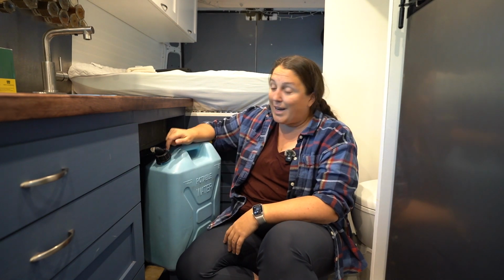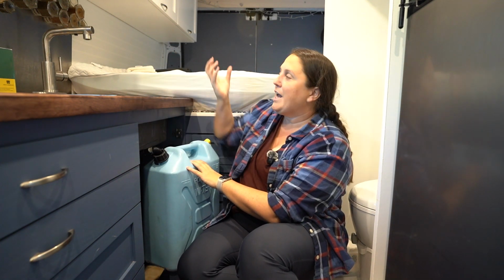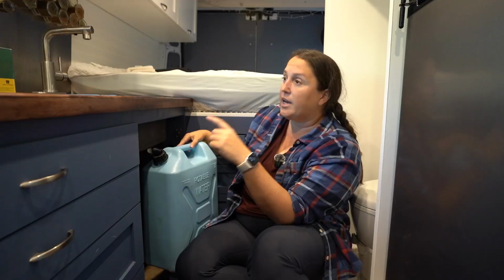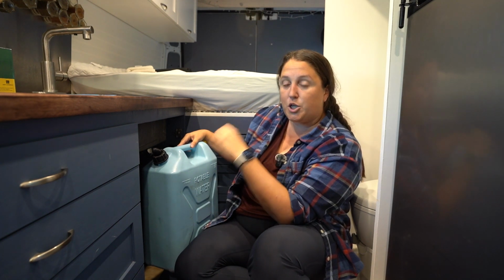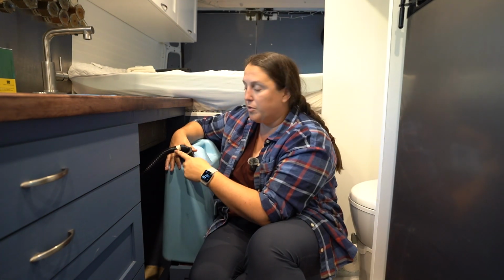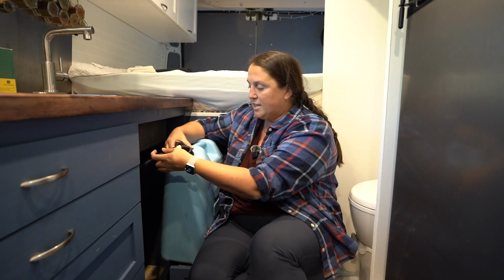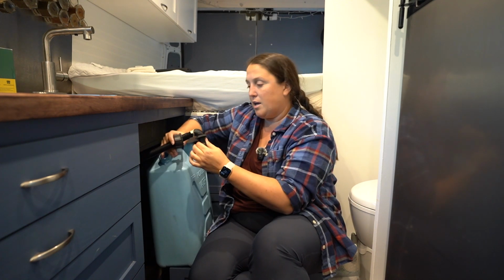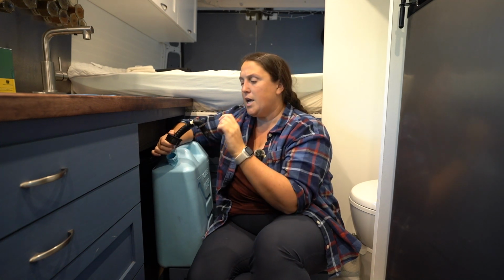The water drains in here through our household sink into a Camco RV adapter, which allows the household sink bottom to be converted to a 3/4 inch hose. It runs then through the hose into this adapter that Andy has 3D printed, and that actually allows us to get a nice seal on this tank. The adapter itself has a little gasket around it. That gasket seals this off so we don't have any stink from our gray water.